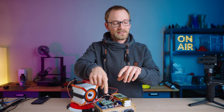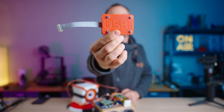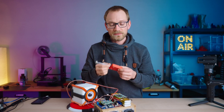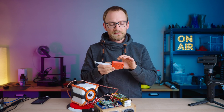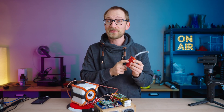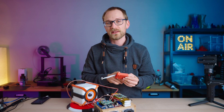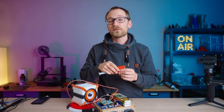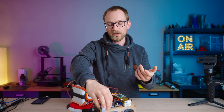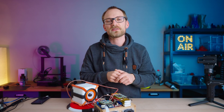To program this DSP you need a bit of specialty hardware. This is a DIY USB-I — Analog Devices, who make the DSPs, also sell these for like a hundred-something bucks, but you can really cheaply make these just based on an evaluation board or application board for the chip used in the official USB-I. It's really simple to make, all the tools are available for free, and I'm gonna leave some links for the programming hardware in the description. That just plugs into this board, and then this DSP gets flashed and permanently written to the little EEPROM on this board.